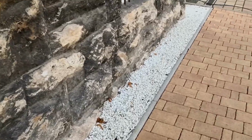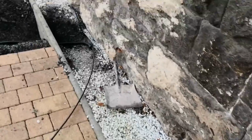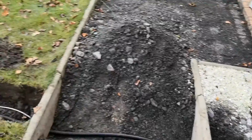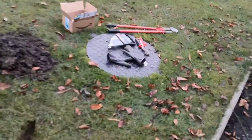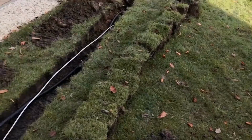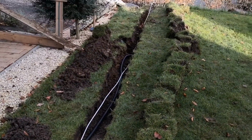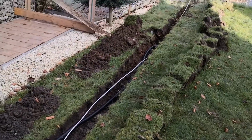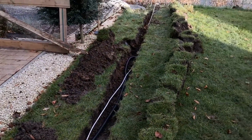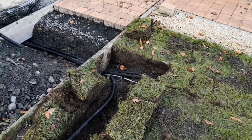The cable goes around the corner of the house. There is the other grounding electrode there. I will just connect that a bit. Afterwards, the grounding electrode should be back to the level where it belongs. In the past, my old grounding electrode was sufficient, but due to the many technologies in the house, I received the recommendation to install the potential equalization, to improve it in order to ensure that there is no possible damage. I have finished installing the conduit and the potential conductor completely.